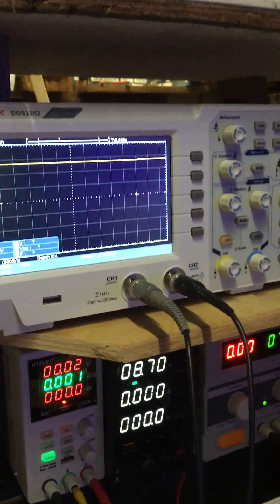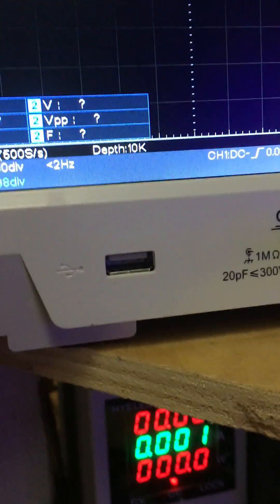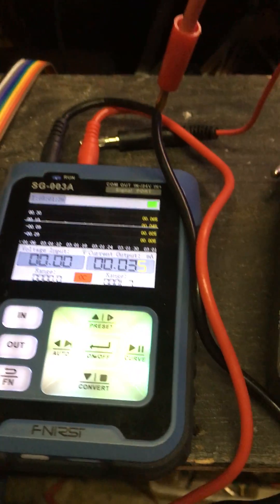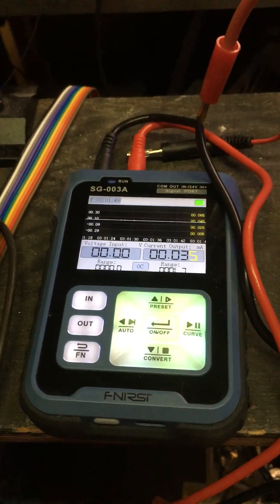I have this hooked up to my oscilloscope and you can see it's about 500 samples a second, which makes a nice roll mode. If you're measuring less than about half a milliamp or so, don't use this kind of probe because it'll cause serious error in your measurements.